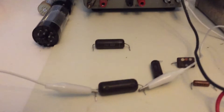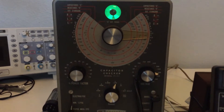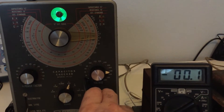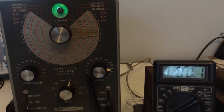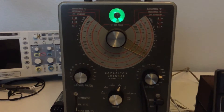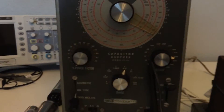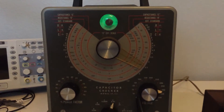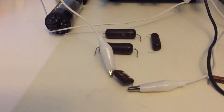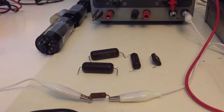The capacitor for the front tube also reads the correct capacitance. Running a leakage test at 400 volts, this capacitor is definitely good at the rated voltage — no issues. The next capacitor, 0.05, also reads the correct value and has no leakage at the rated voltage. The following capacitor also reads correct capacitance with no leak. Finally, the last capacitor is good both in its measurement and DC leakage. All these capacitors are good, so I'm going to clean them up and put them back on the board, then pull out the other ones and test those as well.